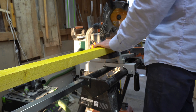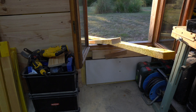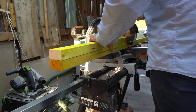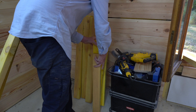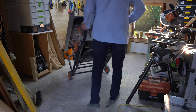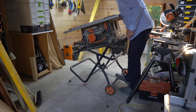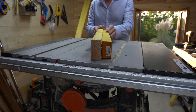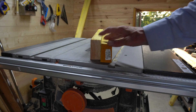In this video I'm going to make the structure of this workbench. To start the process I went down to my local builder's merchant and bought a few lengths of inch and a half by three sawn timber, which was cut to the various components I needed for the major framework with a small allowance for planer snipe.